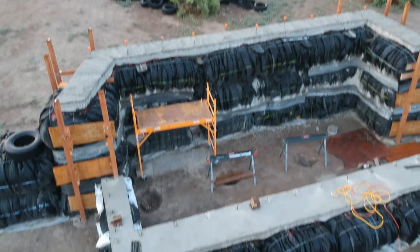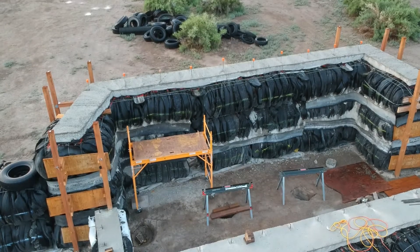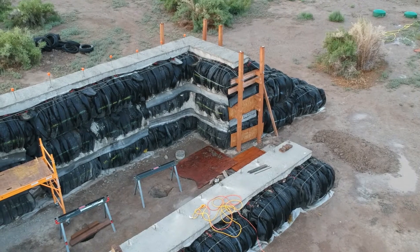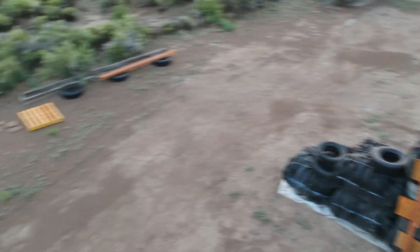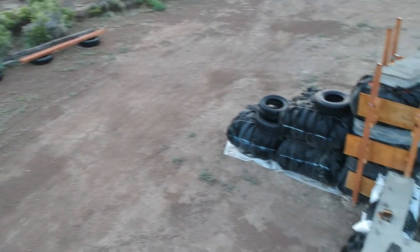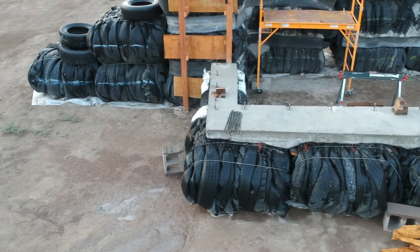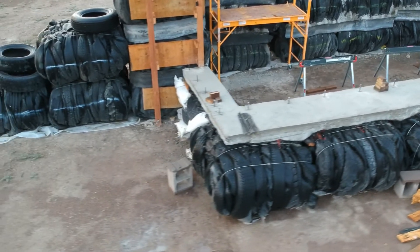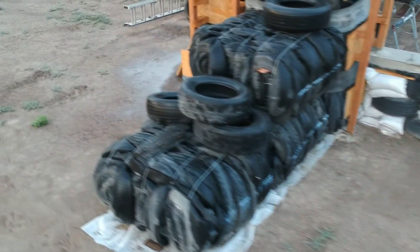The southern-facing side is going to hold the weight of the windows and the window frame. Primary containment of these tire bales is the wires that hold the tires together — there are five on each tire bale. The secondary containment we built consists of vertical 4x4 posts set in 24 inches of concrete, with plywood pressed up against the tires. That's secondary containment should any of the tire bale wires bust and the tires start to expand.